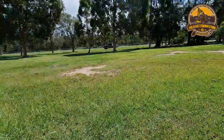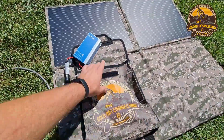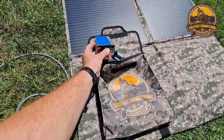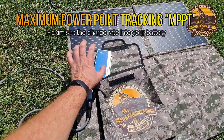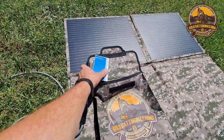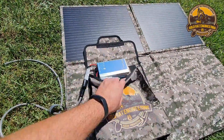I've come down to the park from the workshop to set up our 200 watt solar blanket. This solar blanket comes with a waterproof MPPT controller, which converts a lot more voltage to amps than a standard solar controller. We tested numerous MPPT controllers before settling on this one — it costs a little bit extra but it's well worth it in conversion to power.